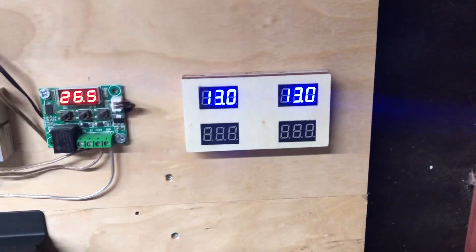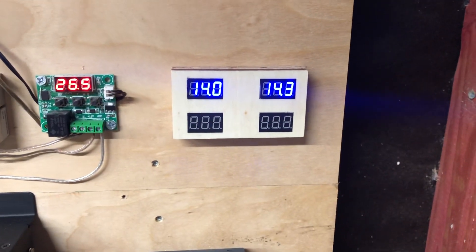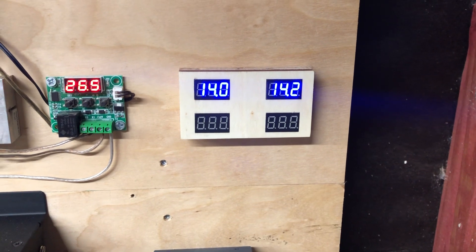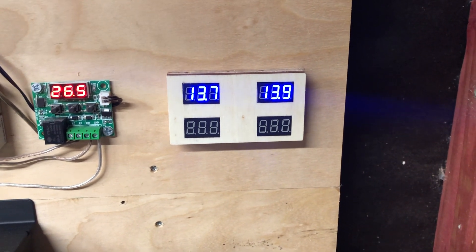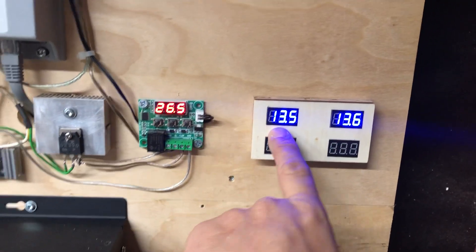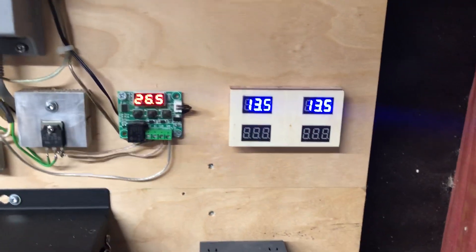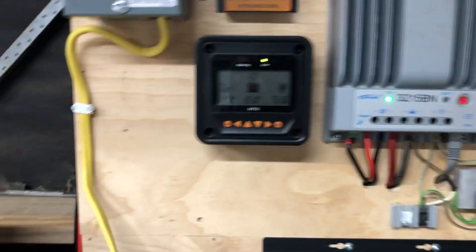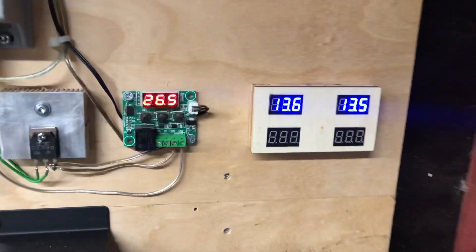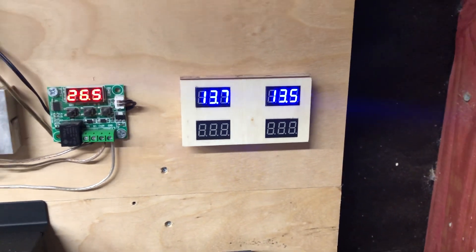After a while I'll turn everything off — I don't have anything connected to it right now — and you'll see the voltage start fluctuating between the batteries. It's kind of interesting how that does that. One may even jump up to 14.5 and the other one stays right around 13.8. Right now they're doing pretty good. The sun's really doing good right now. Everything's charged up this morning. These numbers were kind of all over the place earlier — it was a little concerning, but they seem to be leveling out now pretty good.